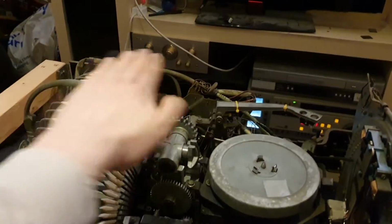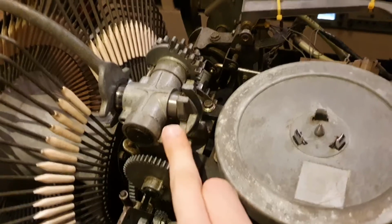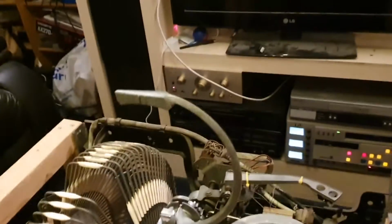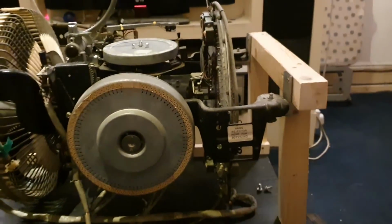And at first glance you'd say, well, we'll just have the window sort of here so it's nice and close to the turntable, but of course you've got to take account for this bow that comes up. So what I've done, I've just disconnected the gripper motor, just loosened a couple of bolts so that this gear can run free, so I can turn this by hand now. There we go. I'll turn that up, get it to its highest point, which is there, and now I can measure from the top of the gripper bow to the bottom of the mech and see how much room I've got to play with in the cabinet, and then I shall cut a set of legs to fit accordingly.